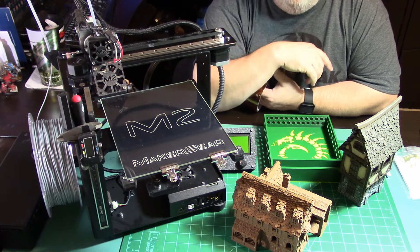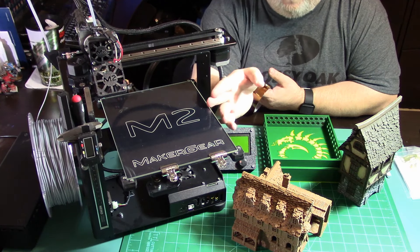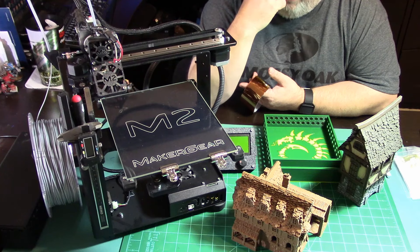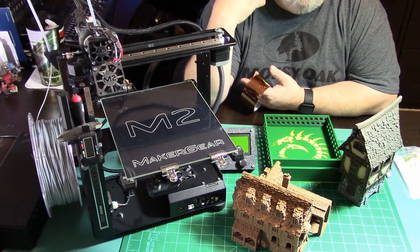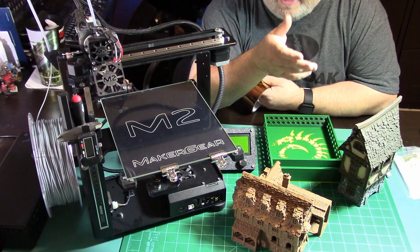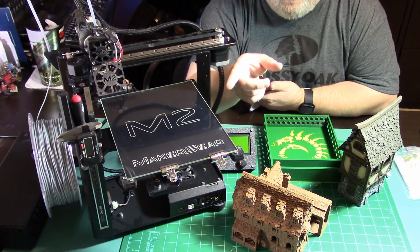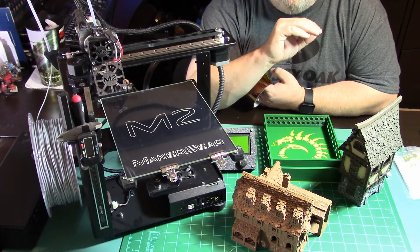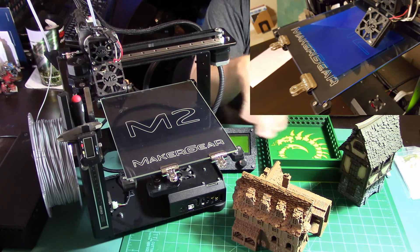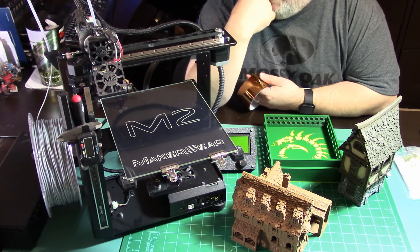Depending on what I'm printing, I can get four to five prints off each glass plate. For me it's hairspray all the way. Some people use zebra plates, some use BuildTak, there are other types of plates. The glass came with the printer; hairspray is two bucks a can and lasts me about two and a half months per can. It hasn't failed me yet, and it's the easiest application ever. When I go to clean the plate I just run hot water and wipe it with a paper towel - all that old hairspray comes right off.